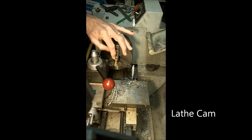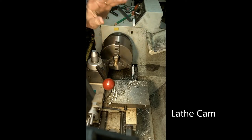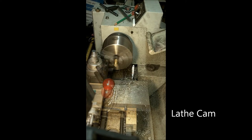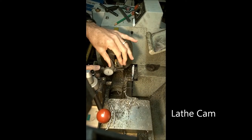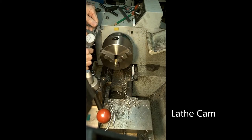By the way, the first thing you want to do when you're turning — before you make a measure — is to take a light cut, make your baseline measure, and then you'll see what we're going to be doing. It went just a little bit over. I'm going to measure what we have. Nice — good baseline measure. I'll come in with a micrometer. We're at 530 thousandths.